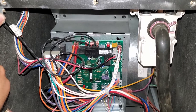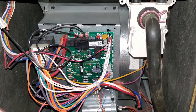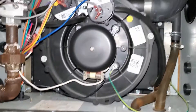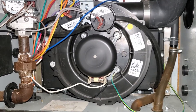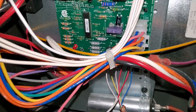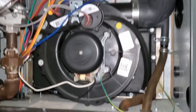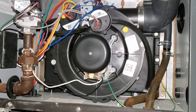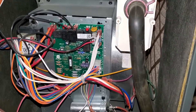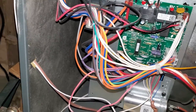Just like that. And that's a safety feature to clear out any gas or air that might have some propane or something like that in it. So I'm going to let go of the switch. If you look at the code down there, it's flashing 1, 2, 3, 4, 5, 6. So then the upper combustion blower is shut off, and the furnace main blower keeps running. That's what this particular furnace does. Let's see if we can find that code — this is helpful for troubleshooting.